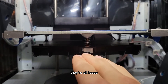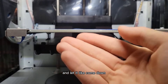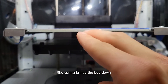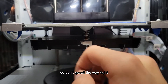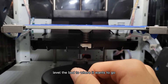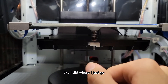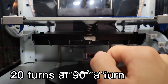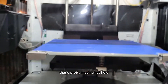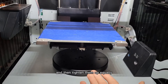Once they're all loose, you're going to tighten them equally all the way around and let the bed come down. When you tighten it, it compresses the spring and brings the bed down. You want to bring it down somewhere in the middle — don't go all the way tight, because you want enough play for when you calibrate it to actually level the bed. I did about 20 turns on each one. Then once you've cleaned everything and loosened and re-tightened them equally, you're ready for the next step.